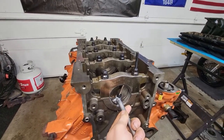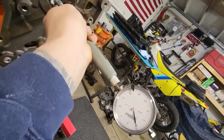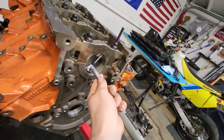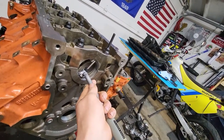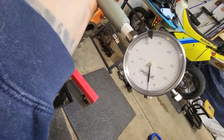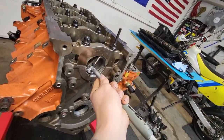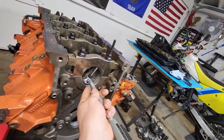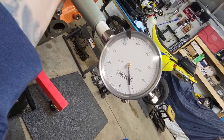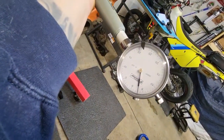All right, we're in the bearing there. Now we come down here to our gauge. Oops, I just lost it. We'll get her back. There we go. So I come down here to our gauge, and we're just going to give our tool a little bit of a wiggle. We just want to make sure that we're finding our proper distance. Now if we read the needle here, if it goes one way, it means it's getting bigger. I'm sorry, I'm one-handed here. I keep dropping it off into that oil groove. Let's see if I can get my finger in there to hold it. There. So what we're doing is watching our needle. When it starts going bigger, that means we're off center. We're making that distance longer because it's measuring at an angle. So what I'm going to do is read our smallest number.